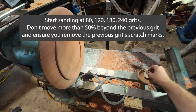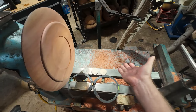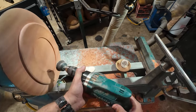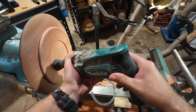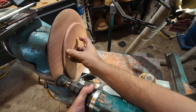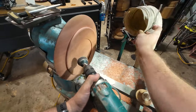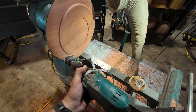So if your tool finish wasn't the best, you might have to start at 80 grit — but don't be ashamed, just start where you need to, then move through 50% of those grits up to 240. I use the drill with the platter running the opposite way to the drill, using the top edge, working it across, making sure I don't roll over the edges so you can still see that nice crisp detail in the recess. I've got my dust collection unit right there, my in-room filter running, and I'm wearing my respirator.